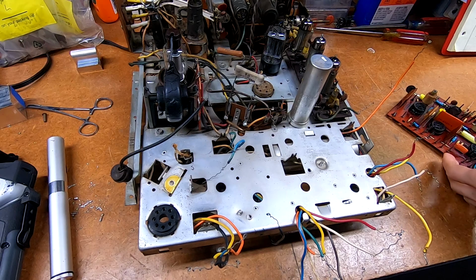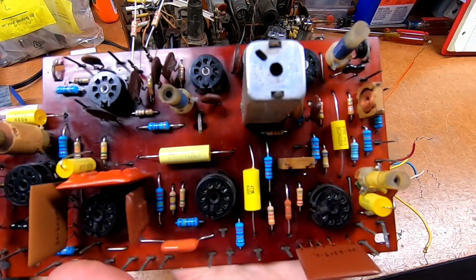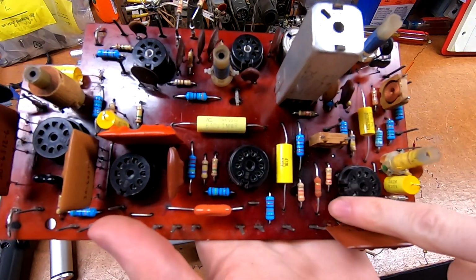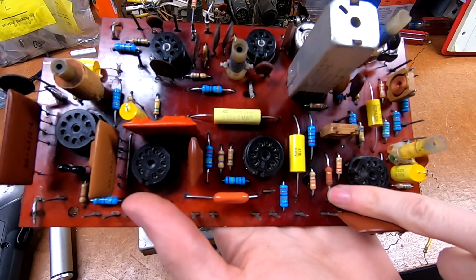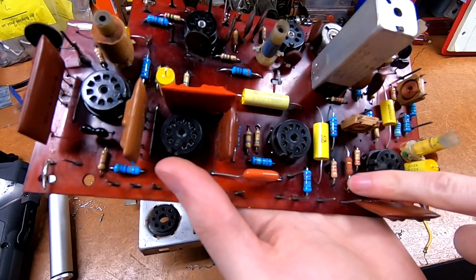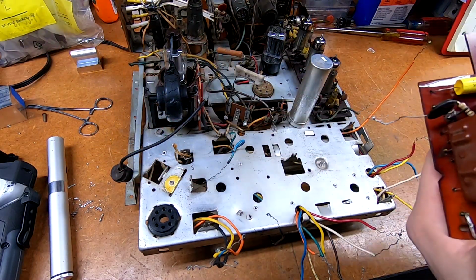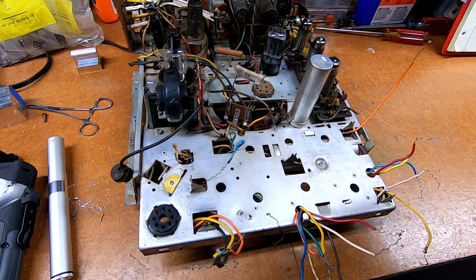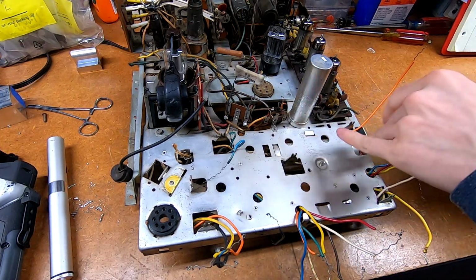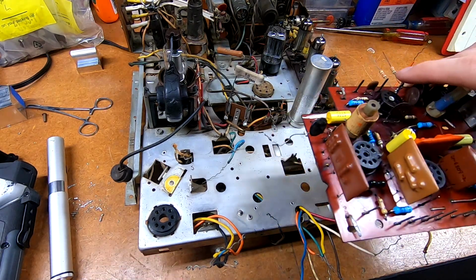Okay, I have finalized the replacement of the resistors on here. I got the 15 mega ohm half watt I needed, and a suspiciously small 2 watt 1.5 kilo ohm resistor. It's a Vishay manufactured one. If they say it can take 2 watts, I'll believe them. They make good stuff, but I don't know. Tried to make sure I got all full-size body resistors.